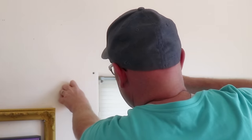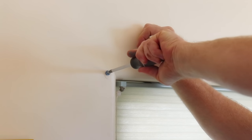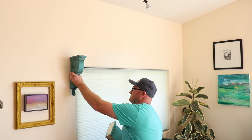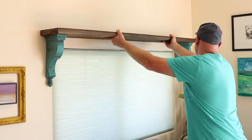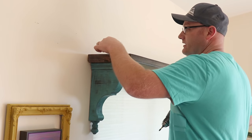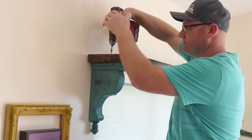This is where we're going to be putting the shelf on the wall — it'll go over the window right here. I'm just going to be putting these anchors in — they're just sheetrock anchors, three-eighths drill bit — and put these in the wall and then the screw goes into this. Now that the anchor's in the wall, I'm going to put this screw in, not all the way, because this is what I'm going to hang the corbel on for the shelf support. I've got a wide angle so you can see how much this corbel shelf is going to change this window and the walls. It's always the moment of truth when I hang things to see how level and square everything is. Oh, it is so beautiful! Last thing — I'm taking these screws, drilling a hole into the top of Debbie's shelf, and anchoring it down into the corbel so everything stays right where it's at.